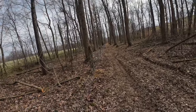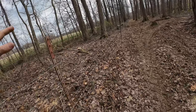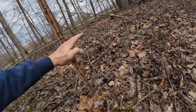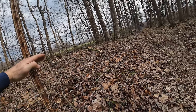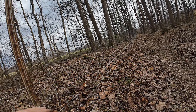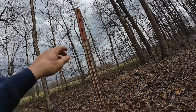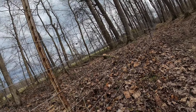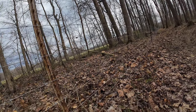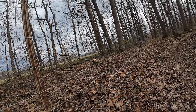I was thinking about something — I wonder if anybody's ever done this. I'm not worried about the height of the fence because I could put electric from here up or whatever. This is where all your problems would be where something would come in. What would maybe make sense — I wonder if anybody's ever done it — if you just folded your wire in half so that it would be really strong on the bottom. When trees fall on it, there's less breakage. You'd have your thicker top wire and your thicker bottom wire both on the ground, and then less breakage because it wouldn't have as far to push down. Then from about here on up, you could go with two or three high tensile wires, whatever you're running, because nothing's going to try to jump through a high tensile electric fence.